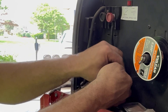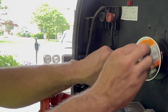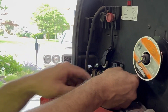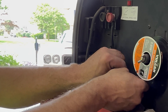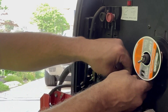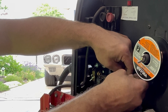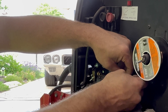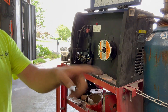I've seen these newer welders have a little switch you can push and it automatically runs the motor and feeds the wire so you don't have to pull the trigger or waste gas. I like feeding the wire through the liner by hand because it should push through relatively easy. If you push it through and hit a really tight spot consistently in the same place, there's a chance your liner has an issue and you probably need to look into replacement. I just like to do it this way and it goes pretty quick.